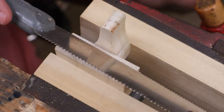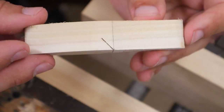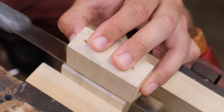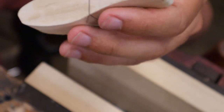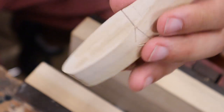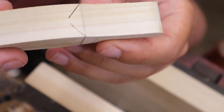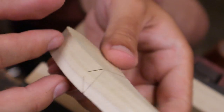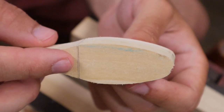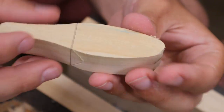But not going all the way through — just going that far with it. So you can tell that those two cuts will meet up perfectly. You can just stick the saw blade in there and finish the cut when it's ready to do so. But now the bait can be carved out in one piece. A lot easier to do it that way, and you don't have to worry about cutting a clean joint after having all the rounded-over edges.